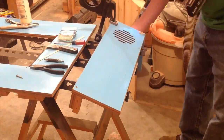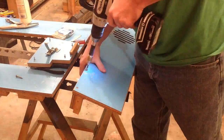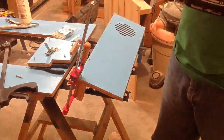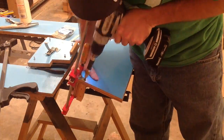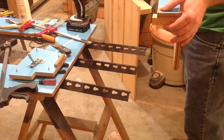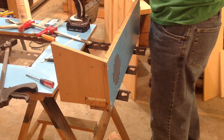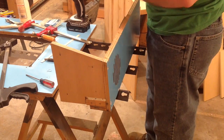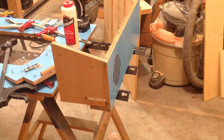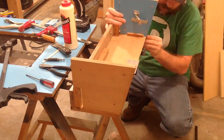All I'm doing here is taking the time to go ahead and secure the connections. Originally it's just all stapled together with a little bit of glue — not really strong. I'm also using this because there's a little bit of warpage along the way. This is all squaring things up, making it stronger so it'll last another 30 years. Just going through, taking my time, gluing up the pieces using strong wood glue.